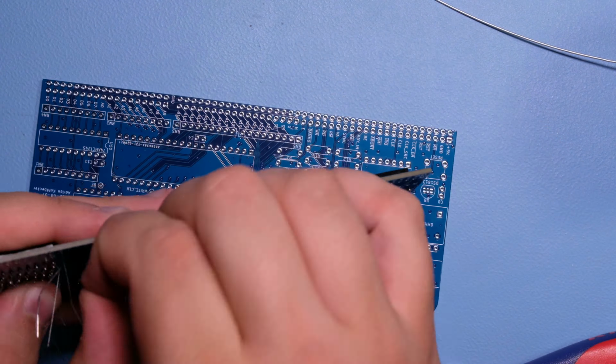So I had some issues with filling some of the ground holes here with solder because I used too much of it, I think. And just to be clear, I did not solder any header on the ground pins over here because on a breadboard, this would just short everything to ground. The purpose of these holes is to add a header for when I want to use this as a mezzanine board on another PCB, such as the whole computer, for example. Otherwise it went pretty smoothly.